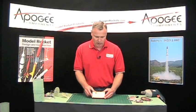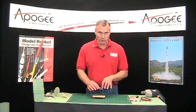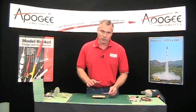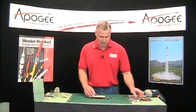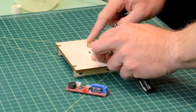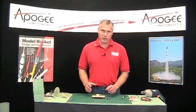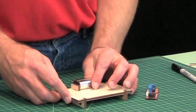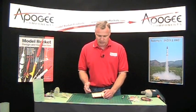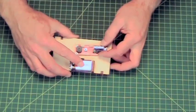Right now we're going to mount our altimeter on the sled. The mechanics are pretty much all the same, so it doesn't matter which altimeter I'm showing here — yours may look a little different, but what you're going to mount is basically the same. This right here is going to be our battery stop. I want the battery to go forward — this is going to be the forward end of the rocket. The deceleration force is worse than the acceleration force when the rocket takes off, so that battery is really going to ram up hard against there. If it went the other way, the battery could come loose and yank itself out, and then we've got a mess.